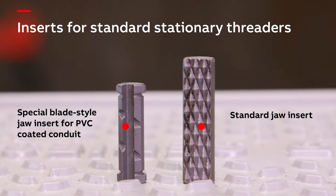Ocal heat cure patch compound offers a thicker consistency at higher ambient temperatures than standard air cure compounds, helping provide better coverage and a more effective patch in warm weather applications. Using a standard chip brush, apply heat cure patching compound in the same manner as air cure patching compound. The compound should overlap the surrounding PVC since the compound only adheres to PVC. To dry, use a common heat shrink gun. The compound should cure in approximately two minutes, resulting in a dull finish. Be sure to build the patched area to the level of original factory coating with as many coated layers as necessary, allowing each coat to dry thoroughly.